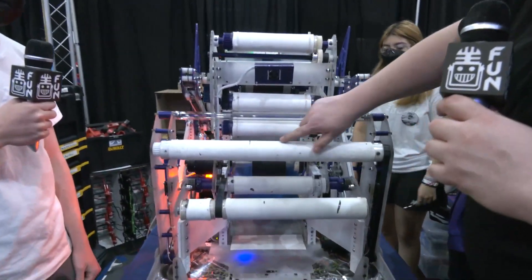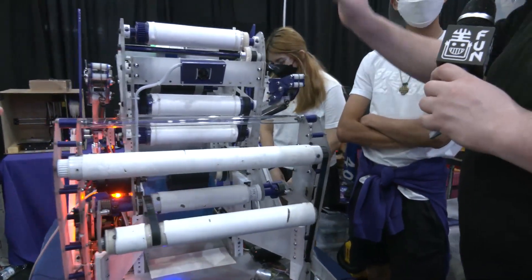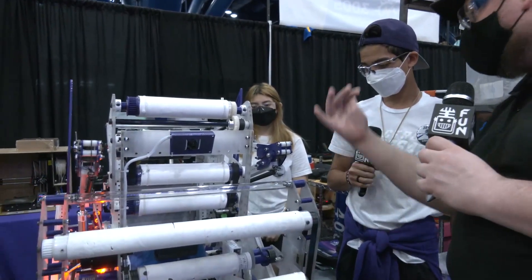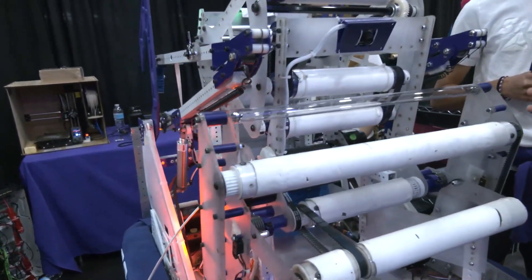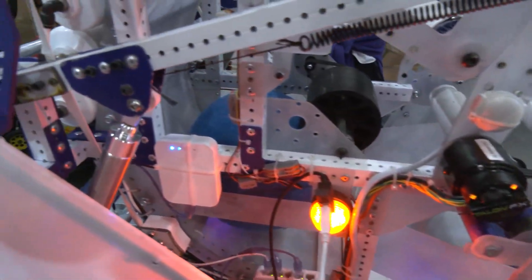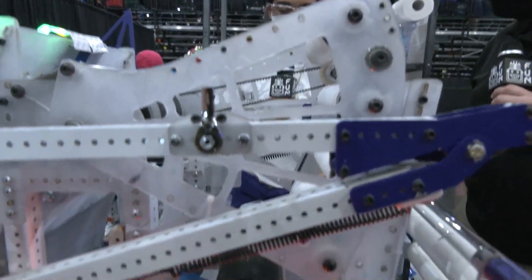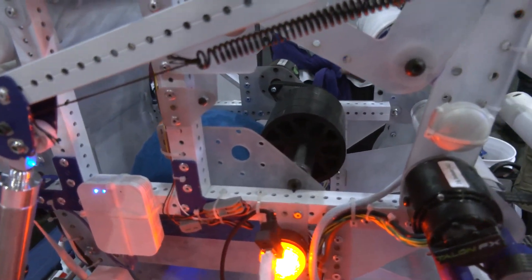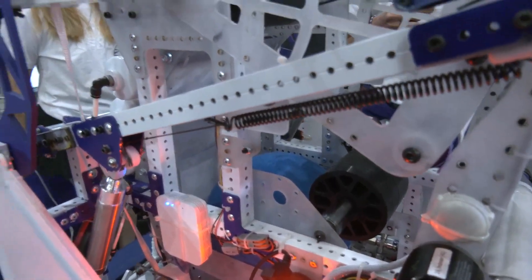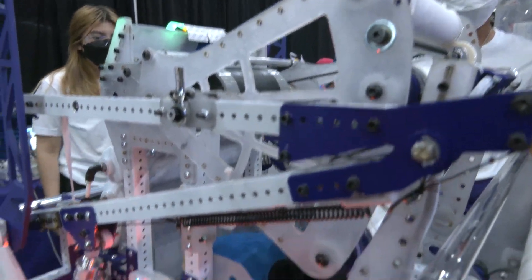To get it on, you have to use a combination of compressed air and a lot of lubricant — it's kind of messy, but once you get the hang of it it works really well. You can find more about that on our build blog. We found it's really grippy, really easy to maintain and clean compared to wheels, and overall a great bang for your buck. Let's keep moving on your robot — we're going to go into that ball pathing and your shooter area. You guys have kind of the S-curve design, which has been very popular this year. The ball path has been working really well. The S shape keeps things really compact — we stack everything on top of each other and stay in one little box. It also allows us to only have one single roller of four-inch compliant wheels, and the ball stays in contact with those wheels throughout its entire path up the S and into our launcher. We only have one motor for it — just a really easy belt. That's it for ball path.